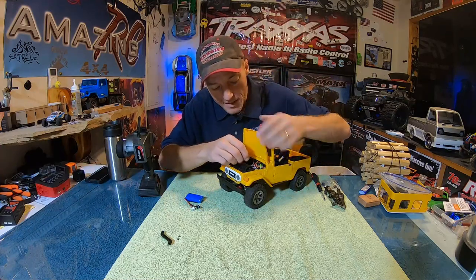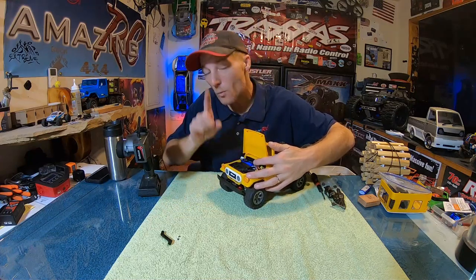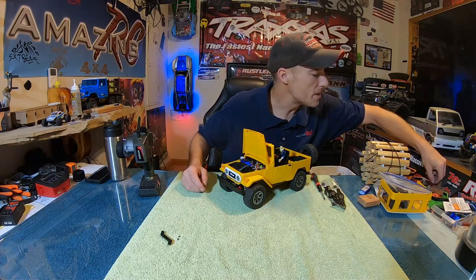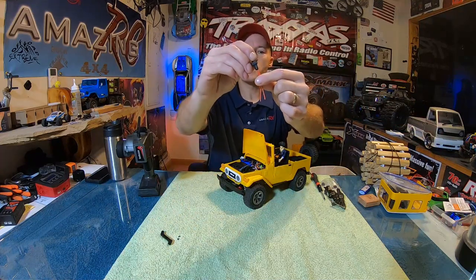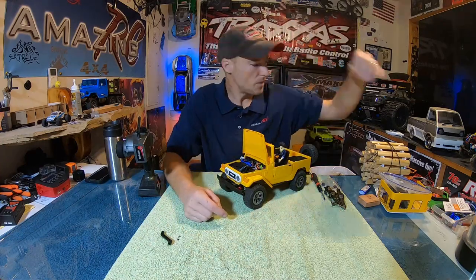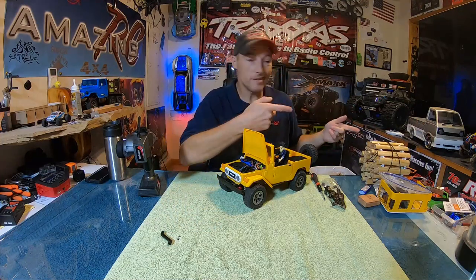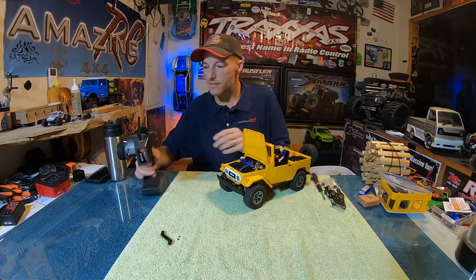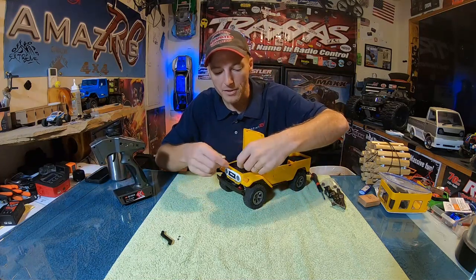Got everything stuffed on this side of the vehicle — that gave me just enough room for my little battery. One of the things I did to save some room is I got rid of the on/off switch that comes with the little chipset ESC. When you're starved for room, getting rid of stuff like this helps out. What I did was basically take the right and left wires to my on/off switch and solder them together. Now what that does is — when you turn on your transmitter — as soon as you plug your battery in, your truck's live.